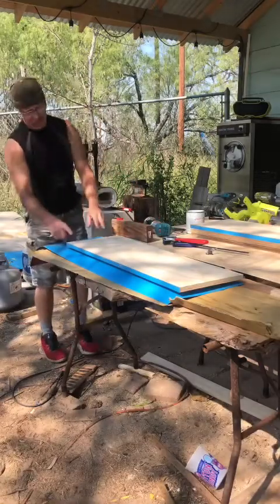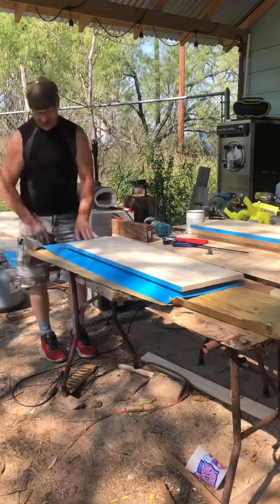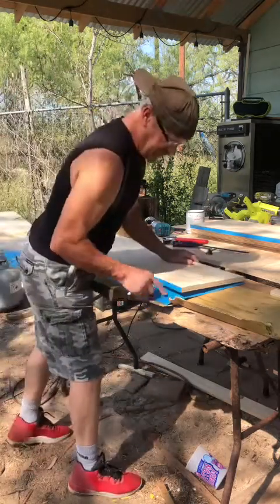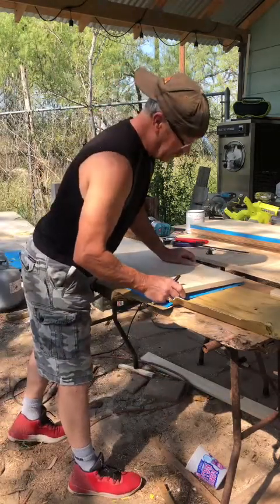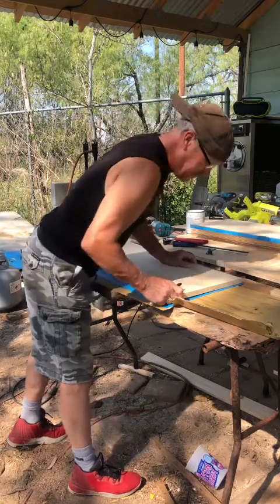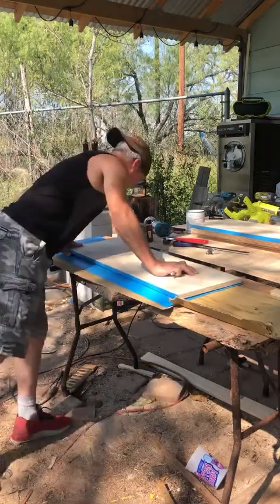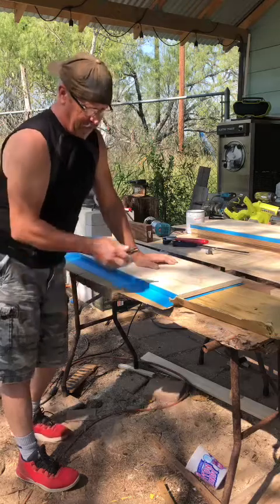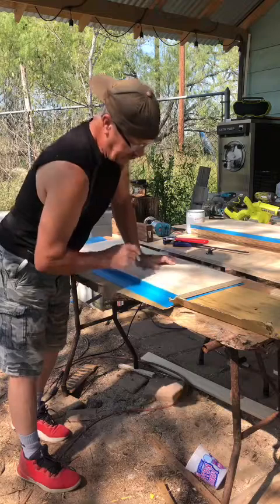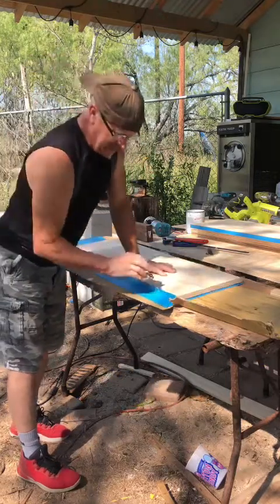I've got both of these done with the front edge piece, so now I'm going to cut a piece of the larger sheet. This generally comes in 4 by 8 foot sheets, so it's a little tricky to work with because it's so wobbly and flimsy, but I had this coiled up so it has a bit of a curve to it. What you want to do to set up for your finish router is leave about a 1/4 inch overlap, because the router can eat that up. It'll eat more than that, but that's a good amount to do.